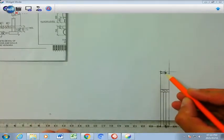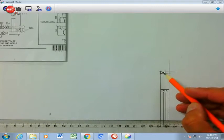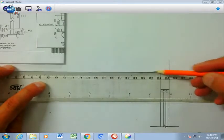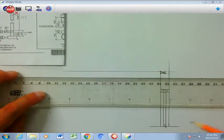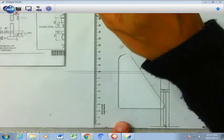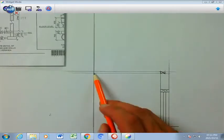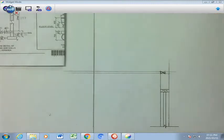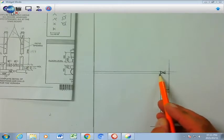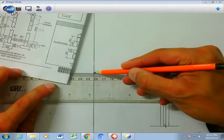You must hatch it, and the proper hatching for wood is a crossing like that. I would also suggest that you extend this line — the top of the wall plate — and extend the bottom part of the wall plate. You're going to draw the entire roof against that line. Keep in mind that later on that bottom line is going to become the ceiling, so you can draw that dark line, because that is your ceiling.